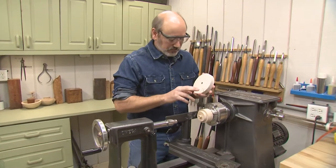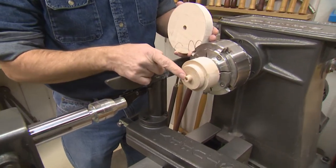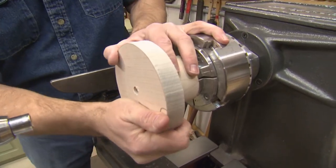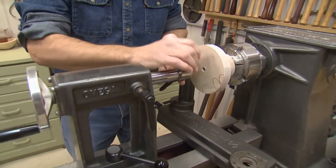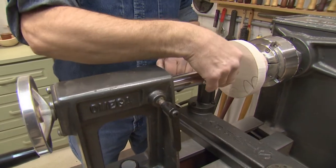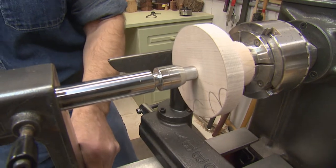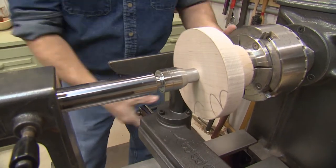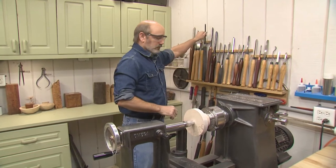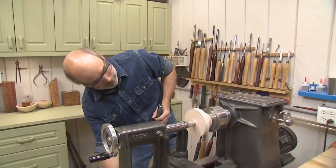I took a little bit of time earlier and put my chuck on here and turned a waste piece of wood. I have a little tenon right here — it's just a half inch round, but just enough. So when I put this on here, it is a tight fit and I can't even get it on all the way. So I'm going to use my tailstock to bring it in. I have a magnetic tip — nice and flat, I don't want any point on here. I lock down my tailstock and crank this out. It's going to force that piece of wood on there nice and tight. Now we're going to get a small bowl gouge and round the wheel out so it'll be a round wheel. Make sure my speed's turned down, nothing's hitting, turn this on and bring the speed up.